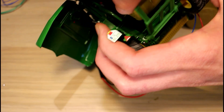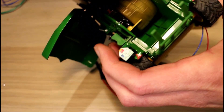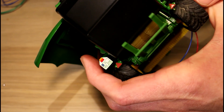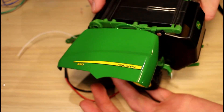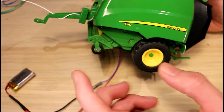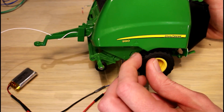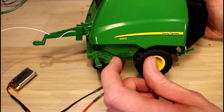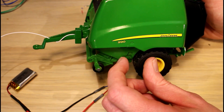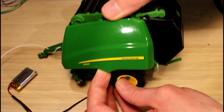The two buttons on the side of the baler are for loading the wrapper only — the tractor will dump them. If you want to load them, you push the bale up there, hit the button to close that one, put your second bale in, and hit the other button to close that down. We have control of the pickup reel as well, but we don't need a button to adjust that because we don't need to set that up every time we load the wrapper. The tractor will just control that completely.